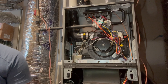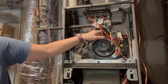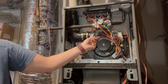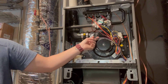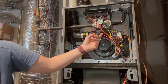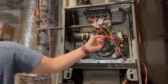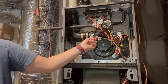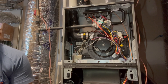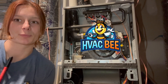Five, electrical and switch testing. On the switch itself, you have an open and close terminal, and you want to check that. Take the wires off and check continuity — you should always have OL. If not, it's bad. You can also keep the wires off while you run the system; test continuity on the switch and it should have continuity when it's calling. Put wires back on, check for 24 volts when calling, then you should drop to zero volts when closed. That would be a few electrical ways to check it. This is Bailey with HVACB and just some overview on a pressure switch.